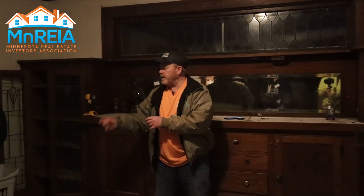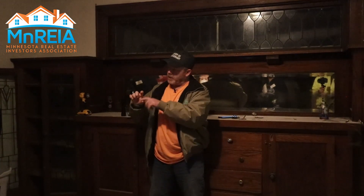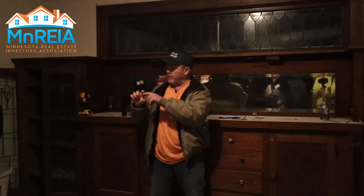In some of the old rental properties, I've actually taken what you would put on the ceiling for crown molding — with a curve on it — and done that on the floor, because it was so bad and it was like the only thing I could come up with that would work. A small cove, not a big cove. Partly because it's got more of an expansion than a quarter round or a three-quarter round is going to have.